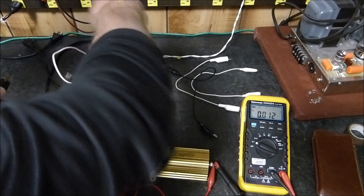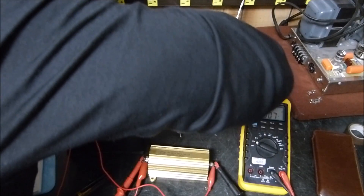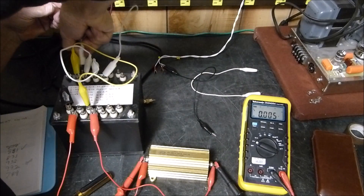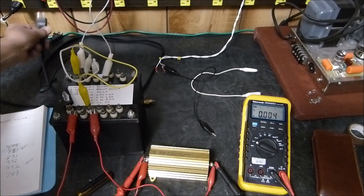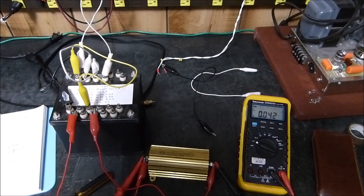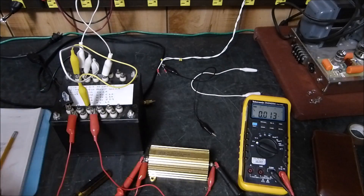Let's go one step further. Let's put the next one in series. I don't know which way is going to buck and boost but I know we're at almost a thousand. I'm going to put it right there and this one right there, and we'll see what happens. So I can get a staggering amount of different voltages out of this thing. There it is — a thousand and fifty-two! That thing is rated a thousand volts so I don't want to blow my meter. 1052 — I'm going to unplug that pretty quick.